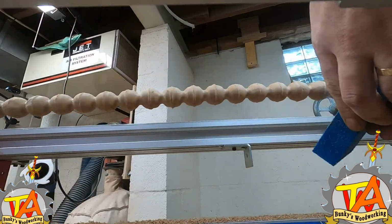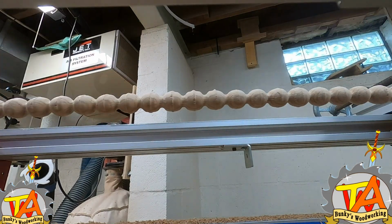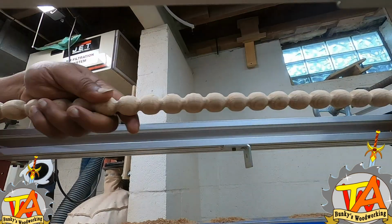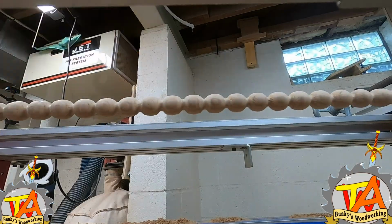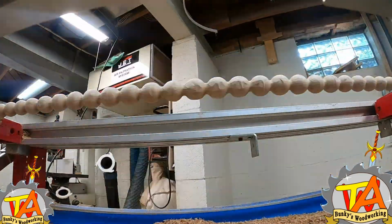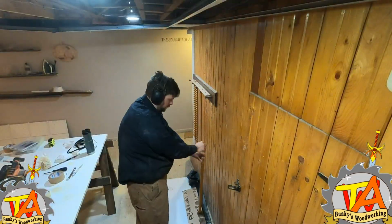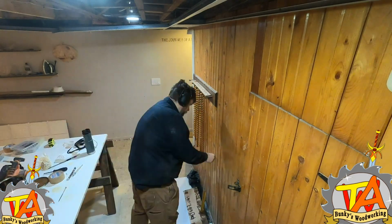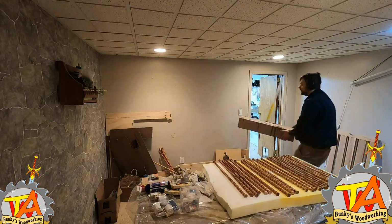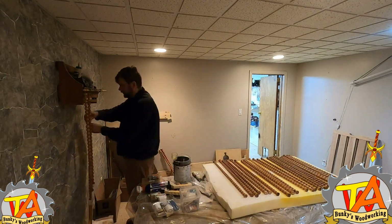I was able to keep the project on the legacy ornamental mill in order to sand it and to apply the first coat of polyurethane. After letting these spindles dry, I ended up making a dunk tank for my polyurethane in order to add the next 3 coats. I also used my walking stick hanging jigs in order to allow them to cure.